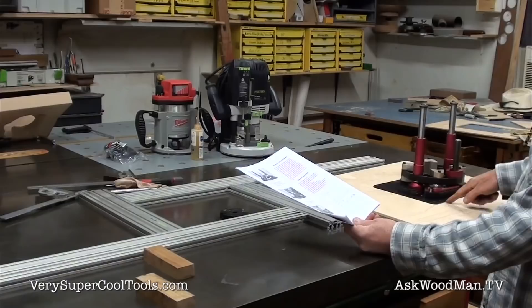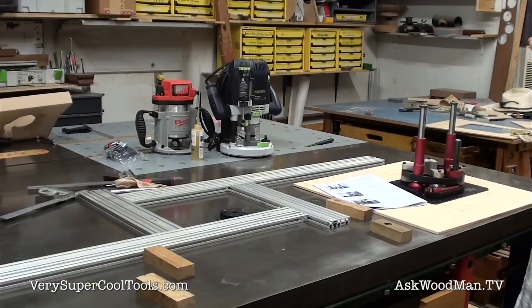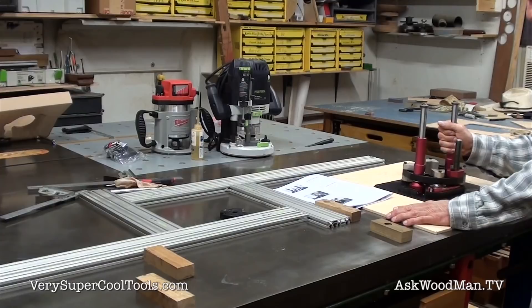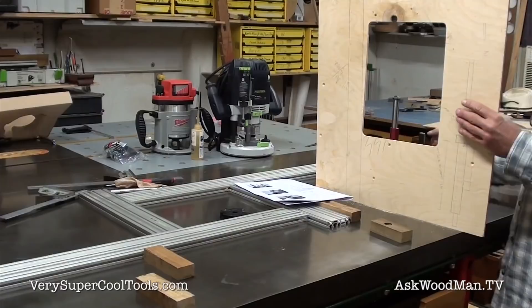My base is exactly 11¾ by 9¼ inches, so I made the conversion and did the calculations. I cut it once and it was just a little bit loose, so I made one micro adjustment. Now I've got it down to half a millimeter of slop — just enough to get it in there comfortably without worrying about chipping the laminate by forcing it in too tight. So I've got a good practice piece now.